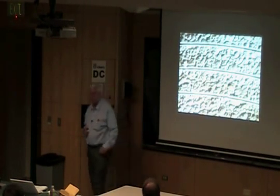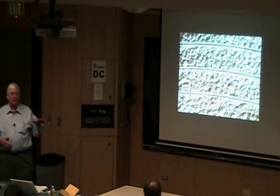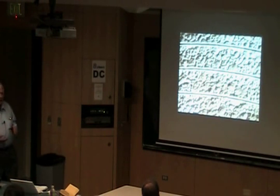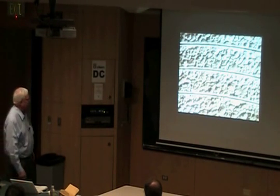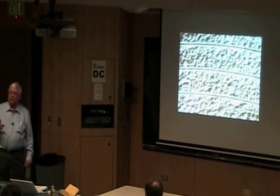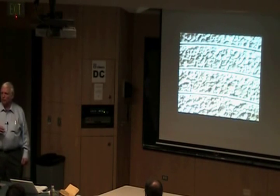For this application, you want the slopes to be out to about 2 degrees and no more, and not much less. So we want to control the slopes, the size, and the depth, as well as the cosmetic appearance, no fingerprints, right? So you can imagine this didn't work the first time. We had to try different solvents. And one of the key issues turned out to be a later surprise. If you just use the solvent, it doesn't work terribly well.